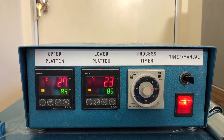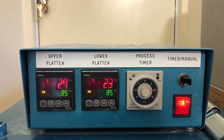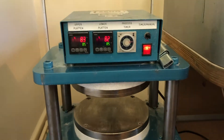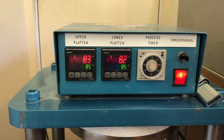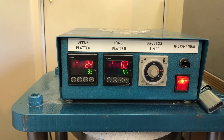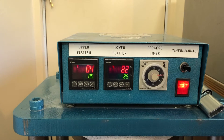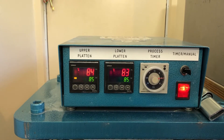I'm going to go off and finish laying out the mould and I'll be back when the temperature has reached 85 degrees. We're back — after a fairly short time, about 10 minutes, the vulcaniser is virtually up to temperature. I'd already started laying out the mould before I turned on the vulcaniser and I've basically just completed it in the 10 or 15 minutes it's been warming up.